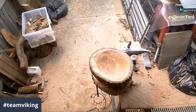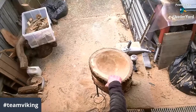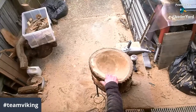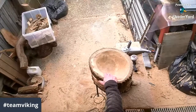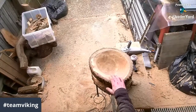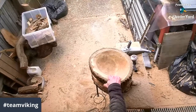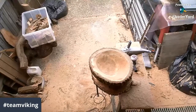Midnight Joker asks: is that cedar very durable for outdoors, like Western red cedar? I don't think it's as close a grain, is it? No, it's not. But it will certainly last for 10 years, probably, outside. You'd notice cracks after a couple of years, I would imagine. But it should be all right. It's a relatively solid wood, if memory serves. And I've got quite a lot of it at the moment, so take advantage of it.